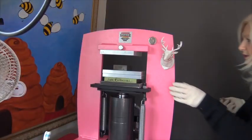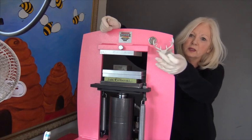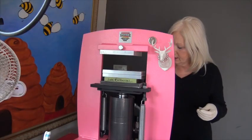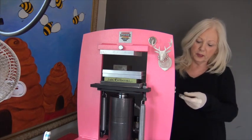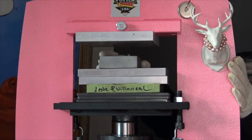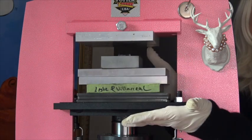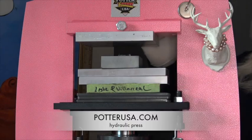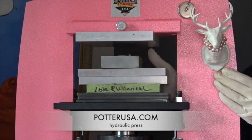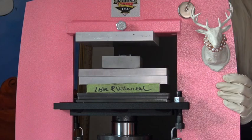My press is all electric so there's no pumping — I'm so excited. It's really big and takes up some room on your bench. It has a really easy up-and-down lever. I want to make sure things are really centered in the press so all the weight is distributed evenly. I have blocks here to ease the spring distance — if you didn't put blocks on, it would stretch out your springs and they wouldn't last as long. If you order a powder press, ask Kevin to hook you up with some extra blocks to keep your springs healthy and give them a longer life.